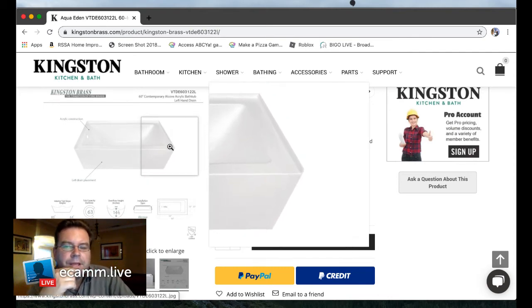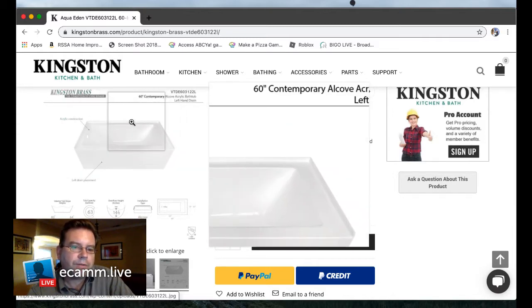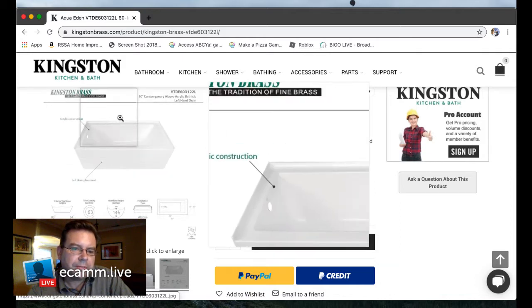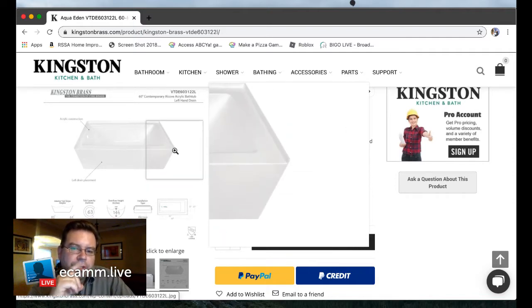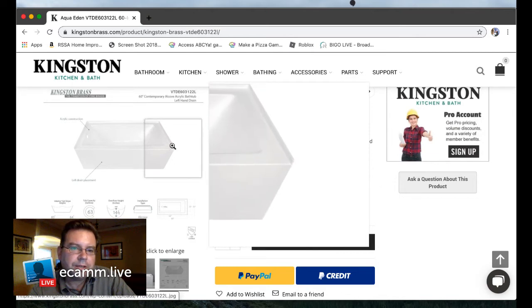So you see right there, that particular bathtub has what's referred to as a tile flange on 3 sides. And what that is, that's just a lip to hold the walls and keep the water from going behind the wall. So the walls actually go over that little lip, whether you're using tile or stone or some other kind of material. And so in that case, with the tile flange, that 22.83 inches, even though it does not say it specifically on the spec sheet, what I suspect that they are measuring is the overall height. But a customer who's shopping is not going to know that. And so I always encourage customers to ask if there is any question that you have.